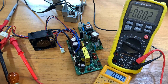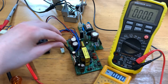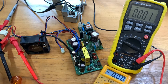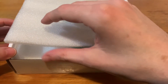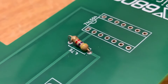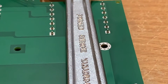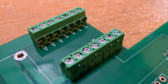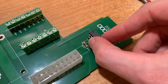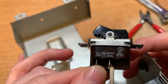After checking everything was fine it blew another fuse. It was looking like I was going to have to test everything again, but people on the internet were saying don't worry about it — it's notorious for dying, just go make yourself a new PSU. So we got PCBs made up for the Pico PSU version 3. It really doesn't have that many components to solder onto it, and I used a little bit of ingenuity to keep the board flat while soldering on the screw terminals. There's the fan plug and the Molex plug for the Pico PSU.